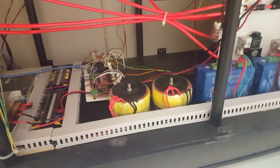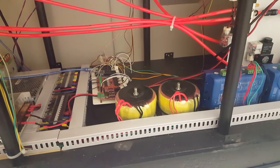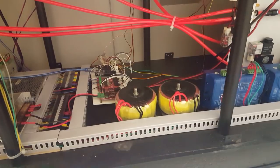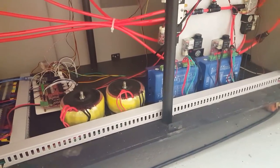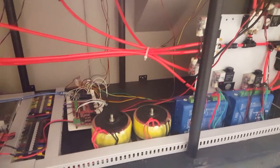And then we got the transformers there. I believe the heaters run on 70 volts. I'm not 100% certain on that, but the backside of those, they did say 70 volts, so I don't know if they're tying them together or what. But that was also confusing, because the machine itself runs off of 220 volts. I had to put in a special 220 outlet for this thing.